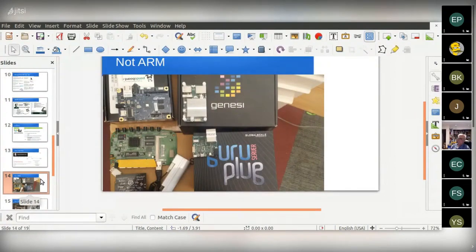There's the Genesee board — that was another ARM device. This board with the yellow tape on it was the Netgear WGT634U, which was the duct tape of the Cambridge public internet and a lot of really interesting ad hoc WiFi projects. I truly believe that IEEE wouldn't have taken ad hoc WiFi seriously if it wasn't for all of these community efforts. The WGT634U had a mini PCI slot — we could stick an Atheros radio in there, and it had USB. We built a ton of these and hung them off city-owned lamp posts.